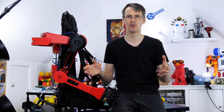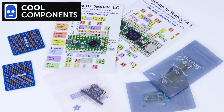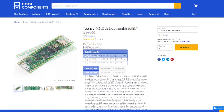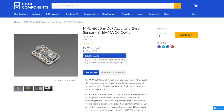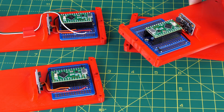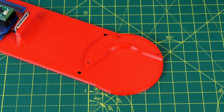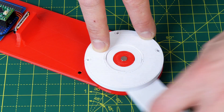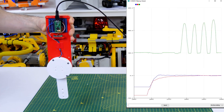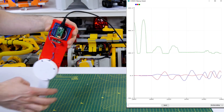In order to start the project, I needed to make some sort of wearable motion capture suit to get all the data from my body motions into something to process it. Thanks to Core Components for providing the electronic components, including several microcontrollers: a number of TeensyLCs, a Teensy 4.1, and the Adafruit MPU6050 inertial measurement units. I made four 3D printed units, each with a TeensyLC on a Core Components perma-proto board along with the MPU6050. I also used AMS AS5047 magnetic encoders attached to each one, which use a magnet rotating above the chip to do rotational position sensing. This lets us record the joint angle of a limb such as a knee or elbow, as well as the position of the upper limb using the IMU — all three pieces of data at once for all limbs.